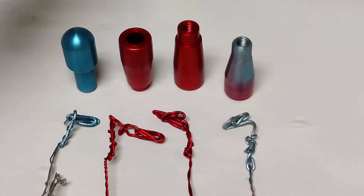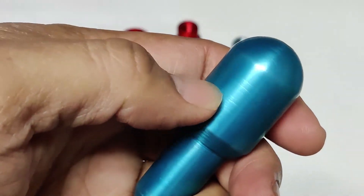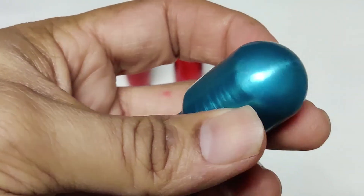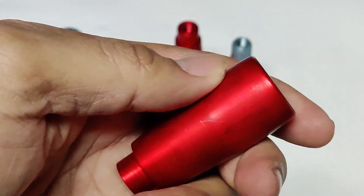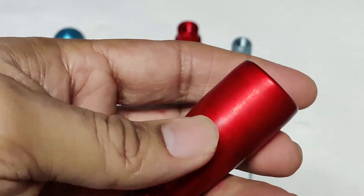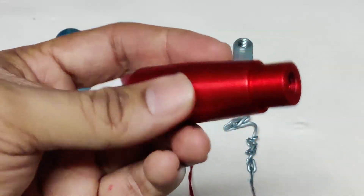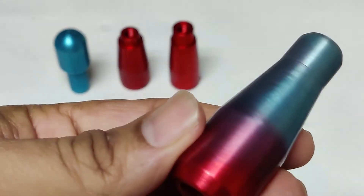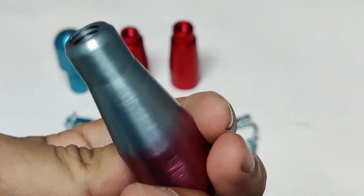Each of the parts are now dyed and should be color stable since I used actual anodizing dye meant for this process. Some parts came out better than others, mostly due to me being lazy and not fully sanding each part down properly. The two on the left have minor scratch marks I can still see since I didn't use my traditional 1200-grit sandpaper finish. The two on the right are pretty much perfect since I did finish those properly. Hopefully you found this useful and it answers some of your questions about how I anodize parts. If you have any questions leave a comment. Stick around for more randomness — this channel always has a bunch of off-the-wall stuff, but until then have a good one.